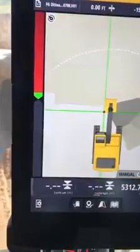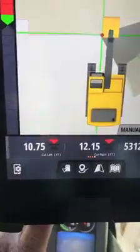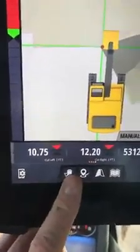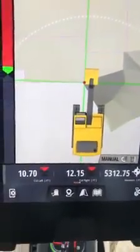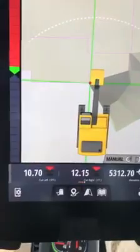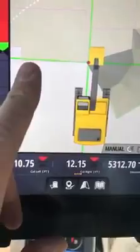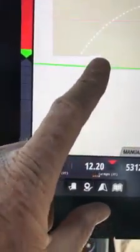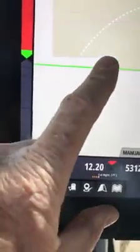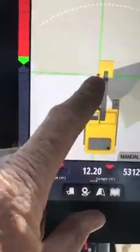So if I come back over here, the little red dot — if you look at the red dot, that's the bucket focus. See right here, there's your bucket focus there. That's what that red dot is right there. So my bucket is hovering right over the top of that corner. That's a deck footing there, there's another deck footing over here, and then the deck goes across here. So there's another footing here and another footing here — I've got to dig out these two footings. And then I've got to dig out this footing.